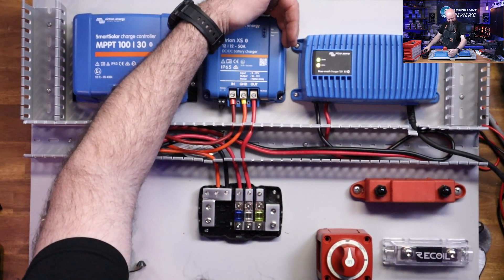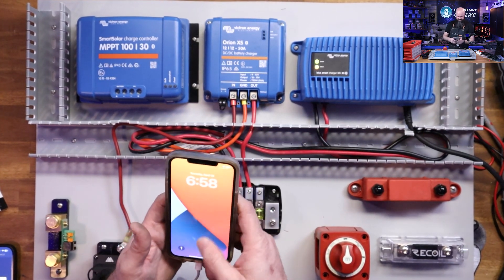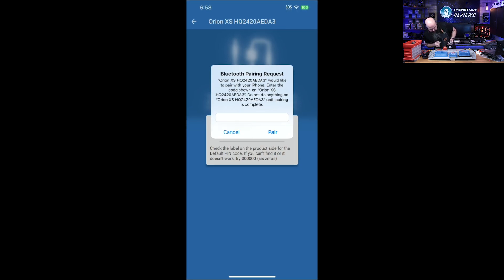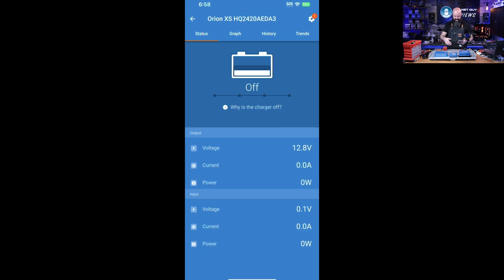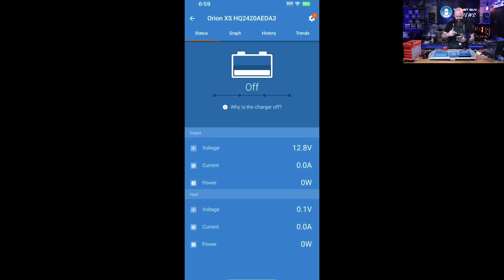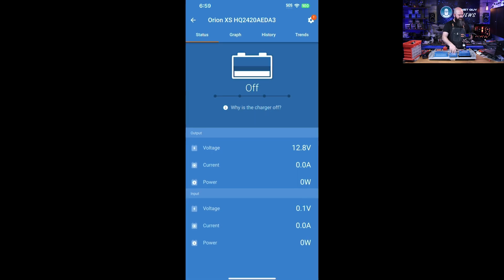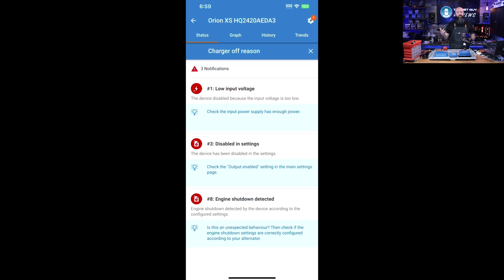The bulk light lit up for a second and it's blinking the Bluetooth, so let me show you how the Orion works. We have one unit outputting in power supply mode and this other one here. It's asking for my PIN. In the app it says 'why is my charger off?' — my input voltage shows 12.8, and my output voltage is 0.1, so it's noticing it has 12.8 coming in on the outside, which is powering itself.